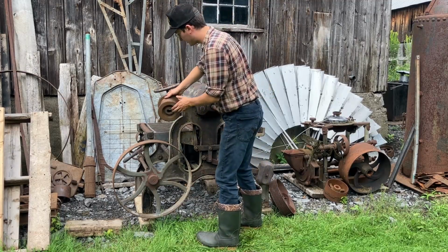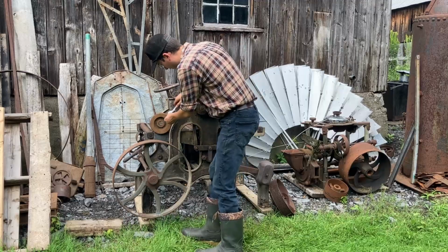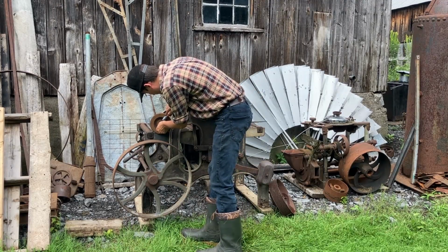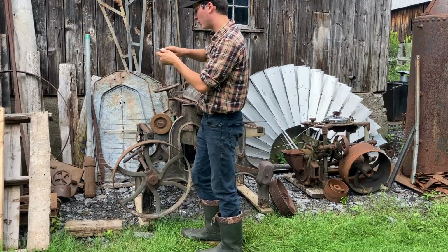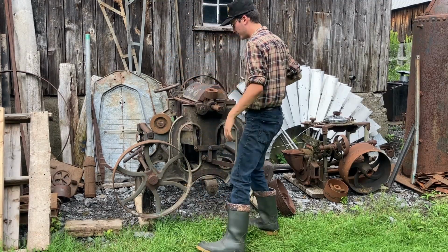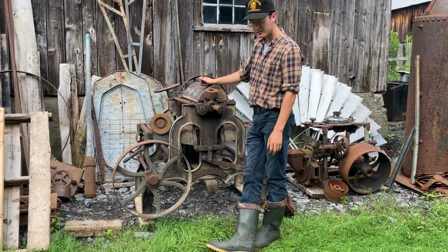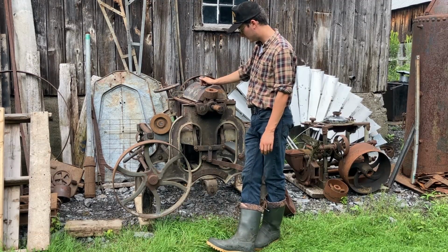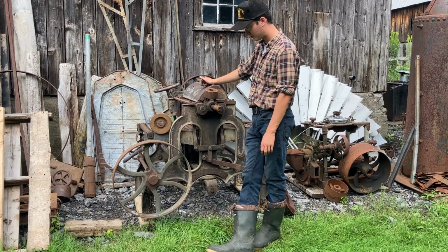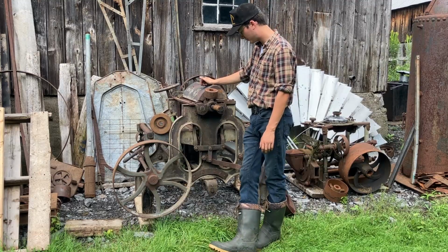And this pulley, which is undersized, it's very close, but a little bit undersized, comes to about 1.365. So we have a fair bit to take off. We'll do it on the flat belt lathe inside the shop and see how it goes. I don't have any set plans, so we'll have to do some tinkering and adjusting as we progress.